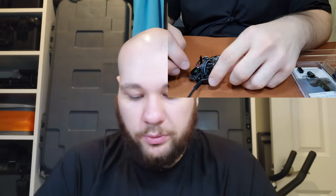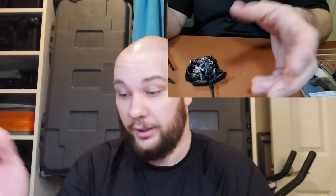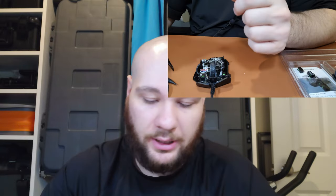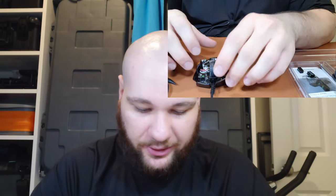The issue that I have, most commonly with this mouse apparently, you get double clicks. And that's partly what I'm getting, but not so much, because it's not that I click once and it registers two clicks, which is apparently very common for computer mice to happen. What I get is when I'm clicking and dragging, it'll stop dragging halfway through. It'll unclick itself. I get that frequently. Although, again, apparently not right now, because I've just plugged it in and it wasn't doing it. Still going to replace the switches.